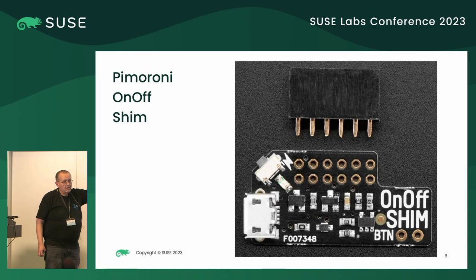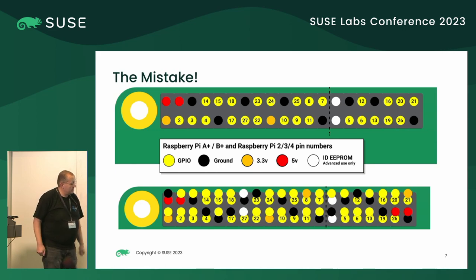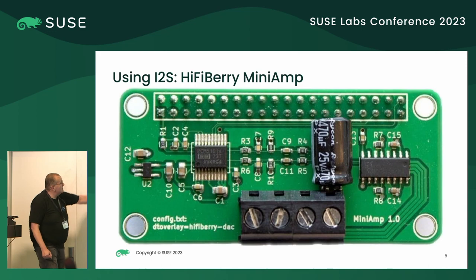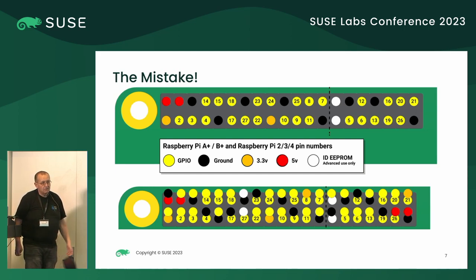To have a nice on/off possibility with the radio, I bought a Pimoroni on/off shim and I connected it. But I made a mistake — I turned the shim. I put 5 volts in the wrong place. This one was okay because it just had 0 between itself, but this one got minus 5 volts, which basically messed up the Raspberry Pi — it broke GPIO 19. Plus, it messed up the chip, the decoder. The problem is that it's the frame sync, and without frame sync, I2S audio can't work because you don't know which data is which channel. So it just doesn't work.